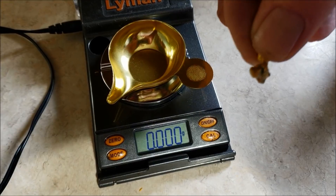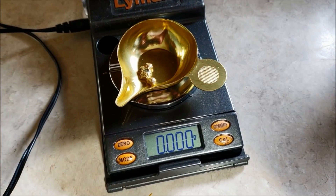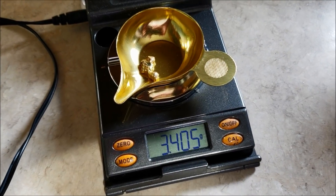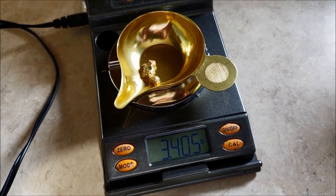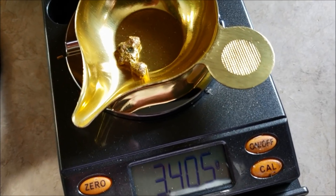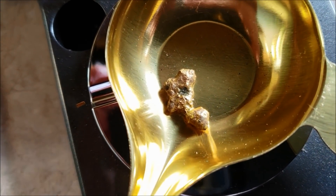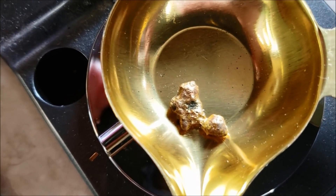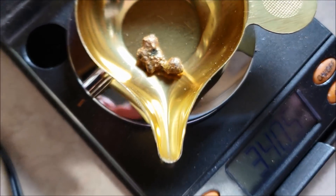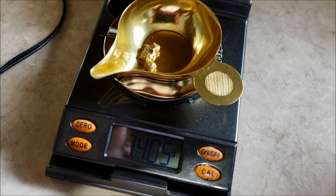Now we're going to weigh our little piece of gold that we got from the memory chips. 3.405 grams — that's not too bad. Thanks for watching, folks. That was a quick condensed version of melting gold off of RAM fingers using aqua regia, and that's pretty close to 24 karat gold. You can boil it in nitric acid a little bit and that'll take the rest of that black off — the black is ultimately the borax from the crucible. Thumbs up if you love gold, subscribe if you want to see more crazy videos. 1881MF, Little Debbie on the Life Buzzing channel.